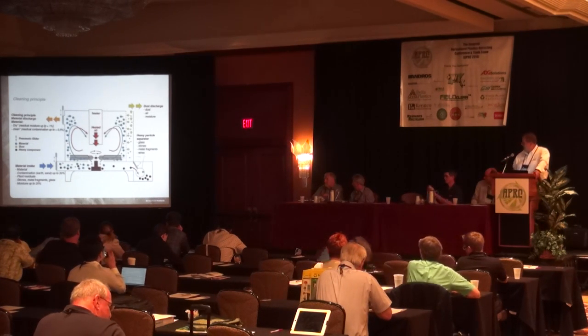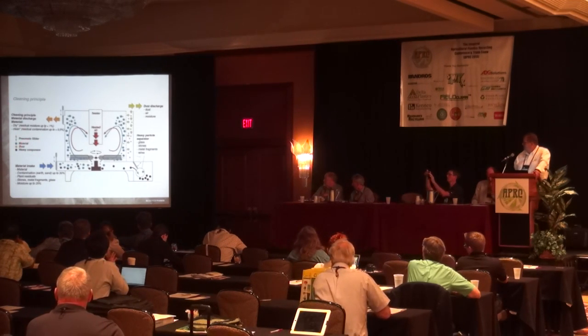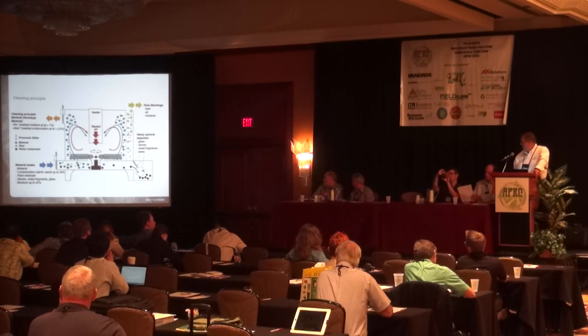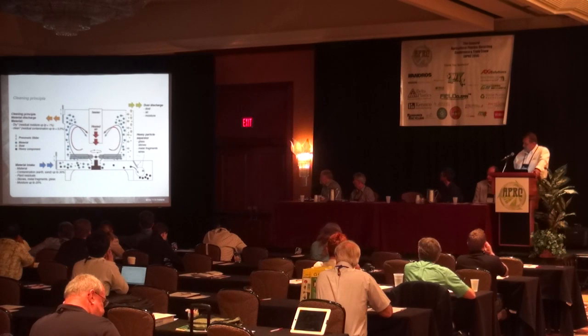The mixed flake with the dirt contaminant as well as chemical contaminants are represented by three different dots. The blue represents the material. The yellow or greenish represents the dirt. And black dots represent heavy contaminants. This could be items like chopped up wires, small pieces of gravel, things like that. The material will all then be sucked into the centrifuge.